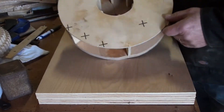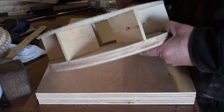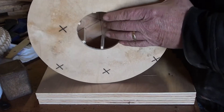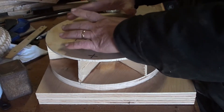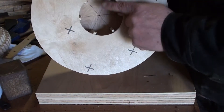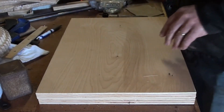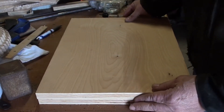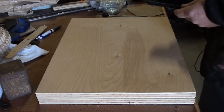For the sake of structure, I went ahead and cut this piece and glued it to the top of the fan. Those blades were a little bit wobbly, but I thought that would help. It doesn't hamper the flow any because the housing will cover all of this — the inlet opening will be about that big. It just adds a little rigidity, gives a little bit more weight, and makes more flywheel out of it.